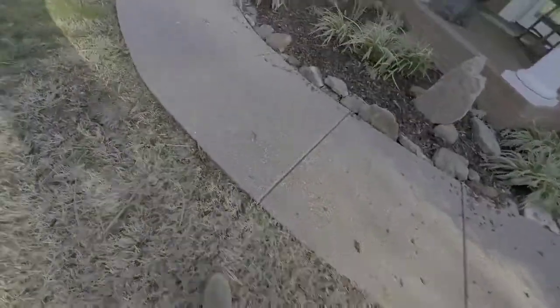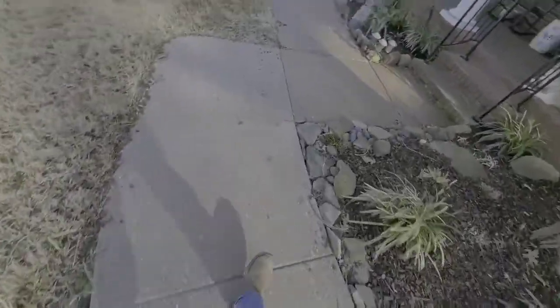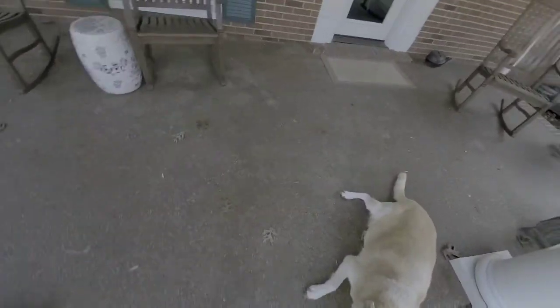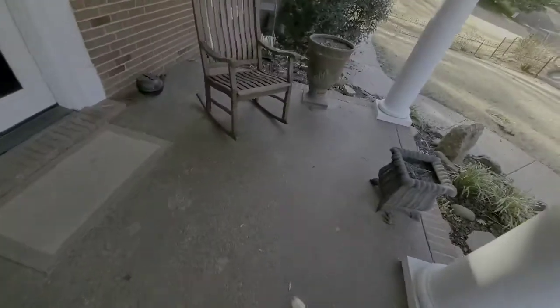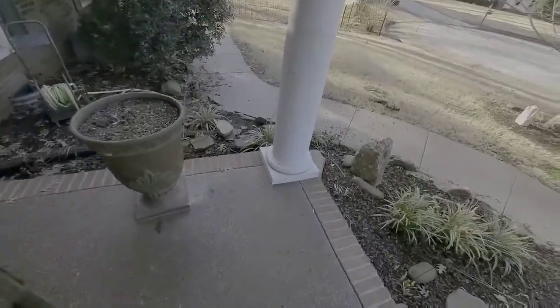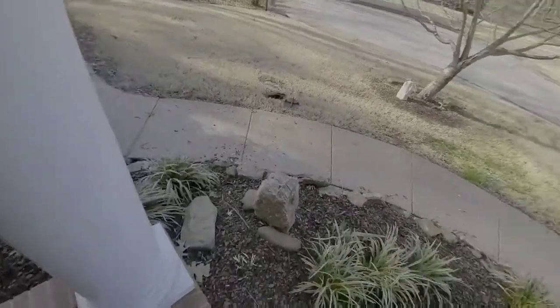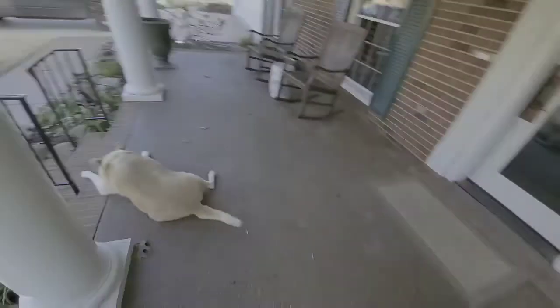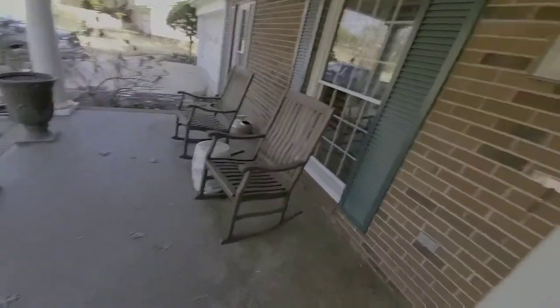It's an indication whether you got your water completely off or not, guys. The meter, this little fan looking deal right in the middle, will spin if any water is going through that line. So if you ever think you have a leak, shut off everything you know of, like all the sinks and faucets and outside spigots. Then come out here and look at your meter, and if it's still spinning, most certainly you've got water leaking somewhere. Little quick tip.